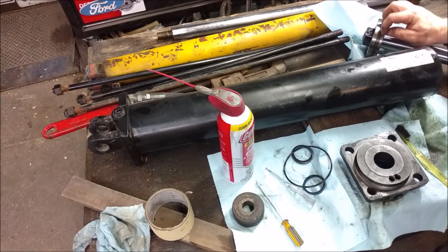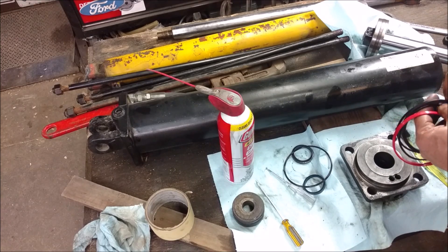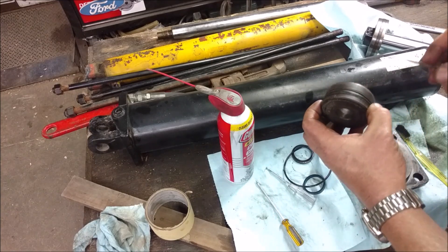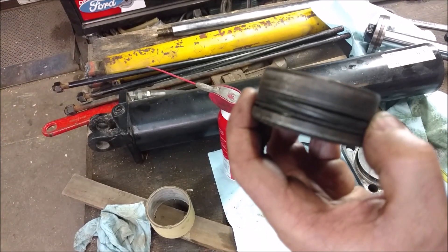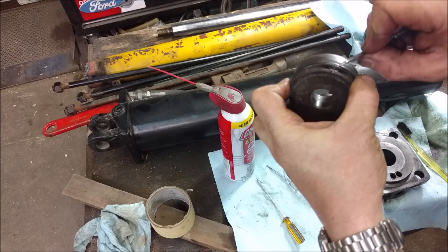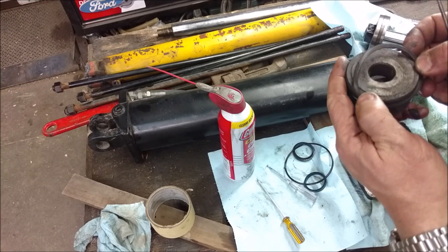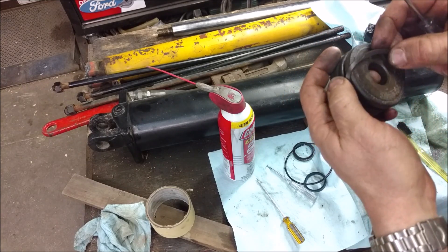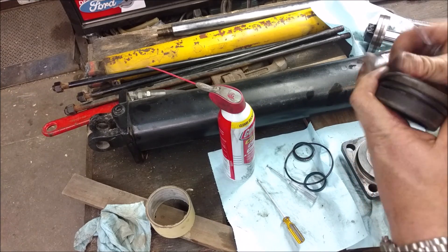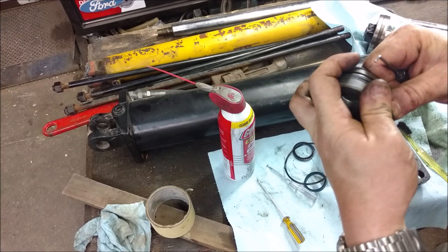I inspected my main seal on my piston and it's actually in really good condition, so I'm not going to change it out. They've given me a three-piece seal to replace it with — a middle piece and then two wipers. But I'll show you what it's like on this smaller cylinder. On this one, they've given a basic O-ring in the middle and then just a wiper on each side. It's a matter of tediously pulling each one off without destroying them and putting the new ones on. It's a little tricky and they seem almost stretched out after you get them on, but you'll get them on. I wouldn't do it in a super cold environment, but they're pretty pliable.